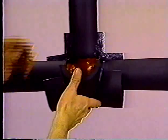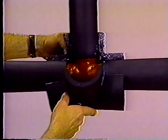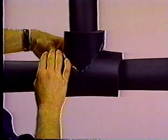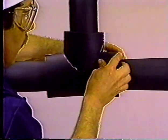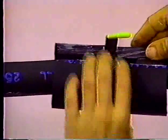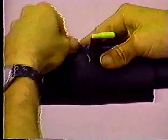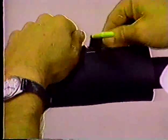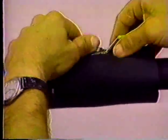There are three simple ways to make tees: the three-piece tee, chisel point, and lastly the saddle method, which should be used for concealed work only. You insulate small valves by butting the insulation up to the valve shoulders, then wrapping the valve body with foam insulation tape to the thickness of the adjoining insulation. Cut a nesting size of insulation to enclose the valve and foam wrap, making cut-outs to go around the packing nut. Apply adhesive and install as usual.